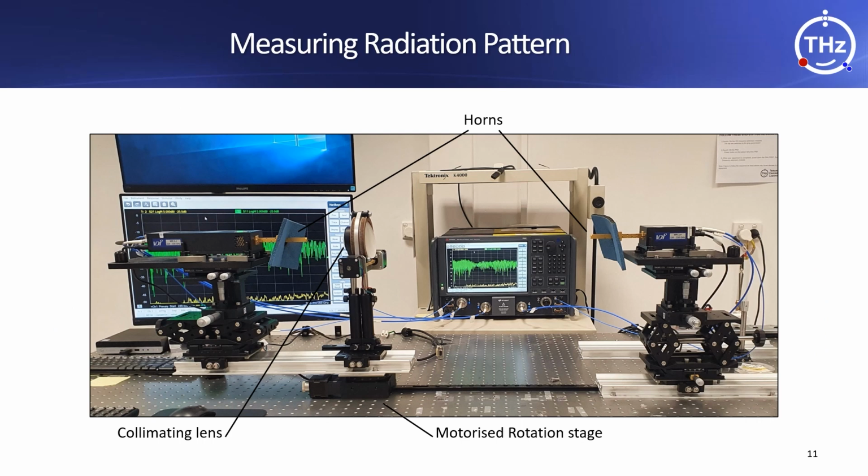Right. So to confirm the Risley prism deflects the beam as we expect, we measure the radiation pattern. The prism is fed with a 14 millimeter diameter Gaussian beam, and the whole setup is placed on a rotating stage, which is then rotated plus or minus 35 degrees, taking a transmission measurement every degree. The far field distance for the 80 millimeter aperture is about 14 meters, which exceeds the measurement capabilities of our lab, so about half a meter was the best that we could do.